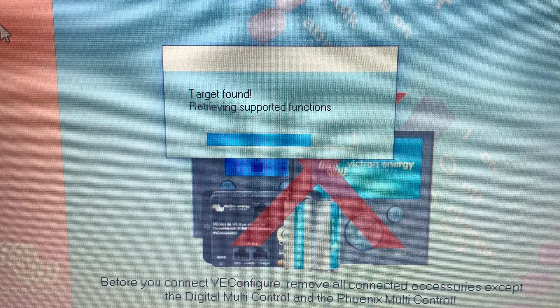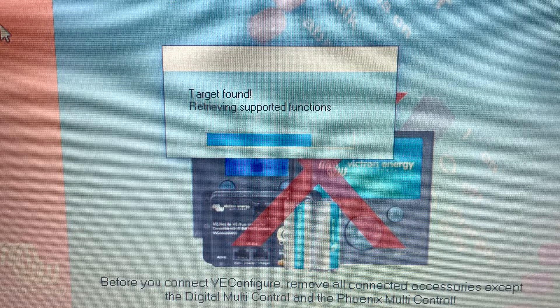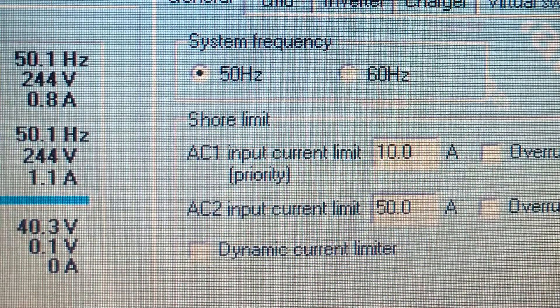I have also connected it to the laptop. All I've done so far is used it to disable the battery charger and set the parameters for the UK DNO. I've also set up the two AC inputs: AC2 will be a 50-amp mains input, and AC1 will be used as the vehicle-to-load, which will only be 10 amps at the moment.